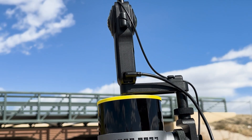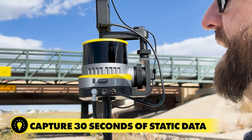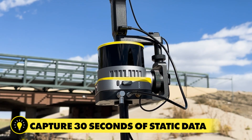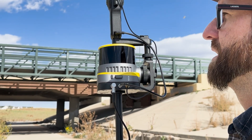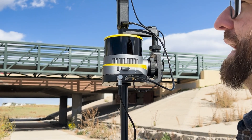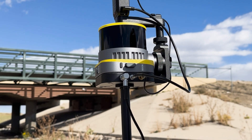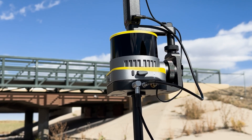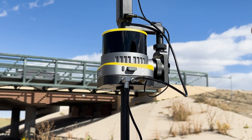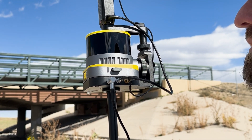What I want to do is allow for a 30-second static data capture. While we're doing that, I'm holding the LiDAR unit as steady as possible. We've moved far away from the underpass so that the GNSS receiver on top of the camera is not obstructed and can receive quality satellite information. However, we're still close enough to features that we're getting LiDAR reflections, which we want.